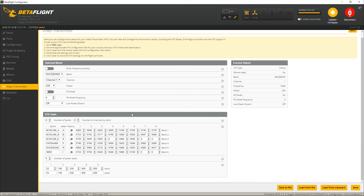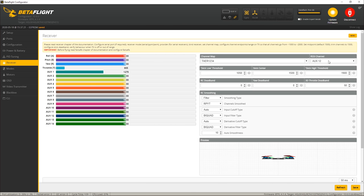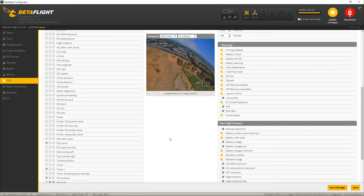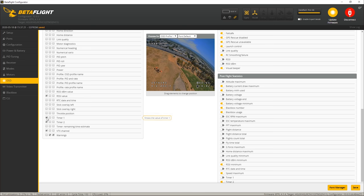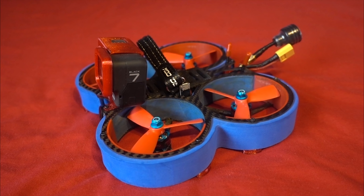The on-screen display had the RSSI disabled when the included XM Plus had the RSSI firmware installed on it, so I added that to Auxiliary 12. And perhaps this is just my personal preference, but for a timer, on-time had been selected instead of flight time, and I don't find on-time any use at all — I like to know how long I've been flying for. To cut a long story short, you're going to need to be accustomed to Betaflight, and I've had to change more settings with this model than I have with any of the other Cinewhoops currently on sale. That's not to say it's not a great model — it just means that you have to be more experienced to get it going.